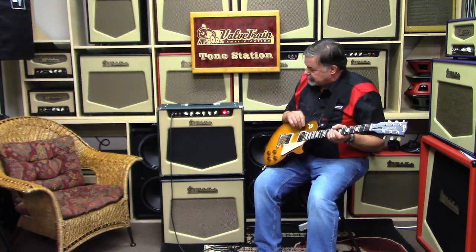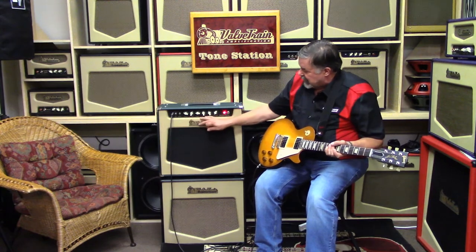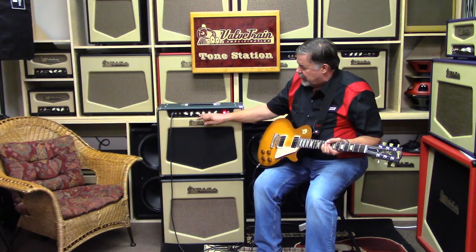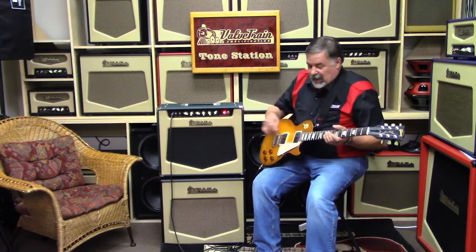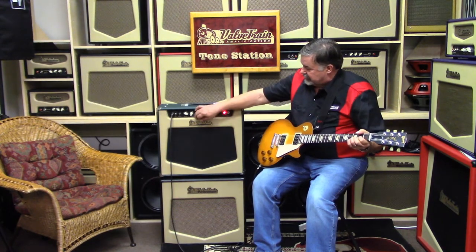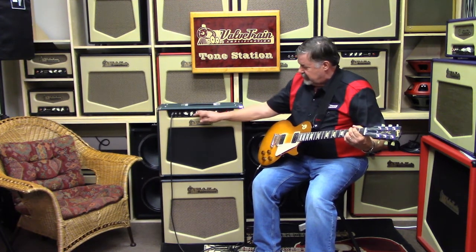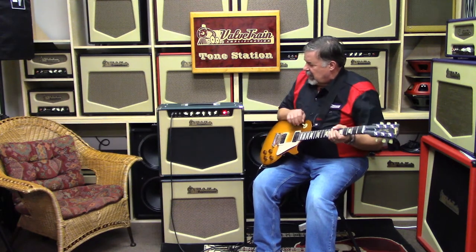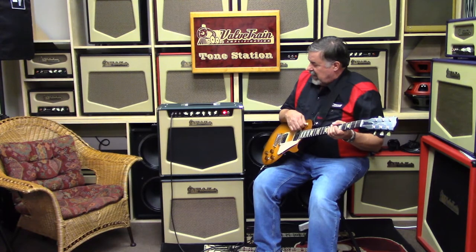So what we've done with this amp are several subtleties. You've got volume, treble, middle, bass and reverb control — sounds pretty straightforward. The mid control from one to four is about full sweep on a mid-sixties Fender amp. But the mid control will sweep up a lot more, giving you a lot more drive in the mid-section than you're currently used to having in a West Coast amp.